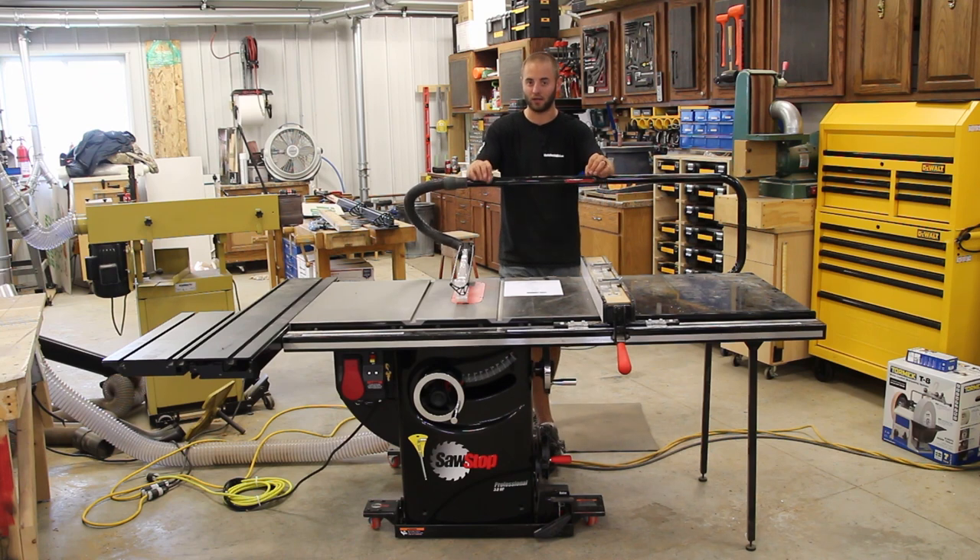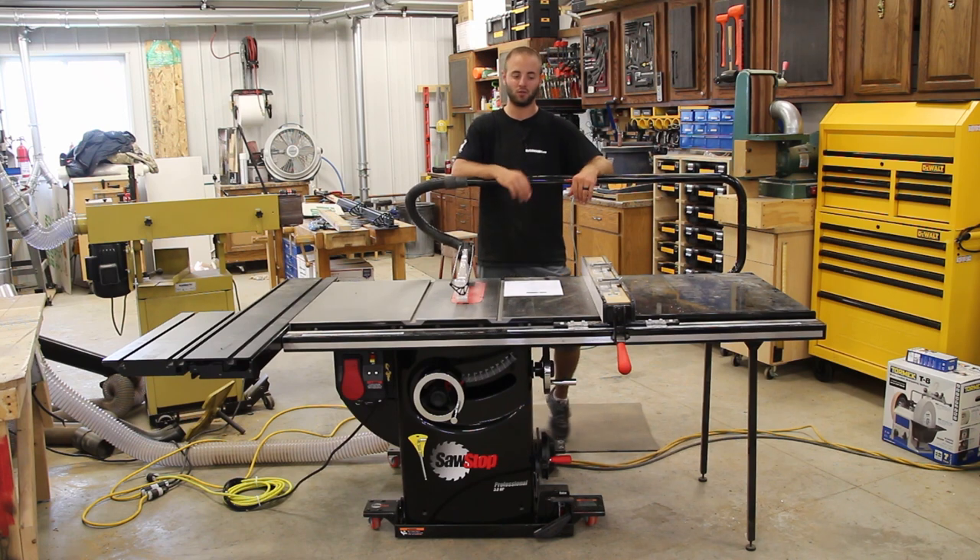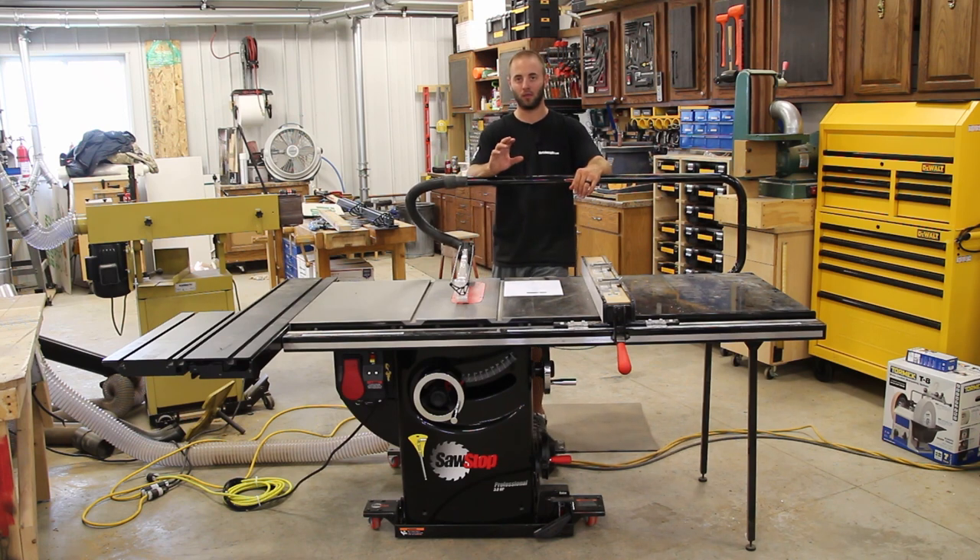The second problem is that when I lift the saw all the way up and move it, to lower it you press down on the lower tab of the hydraulic pump mechanism — but every now and again it will not lower all the way and I'll have to pump it back up and put my weight on it. It could be a design flaw or something on my end, but that's the personal experience I've had.